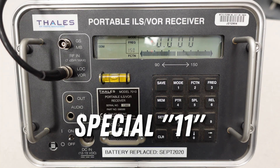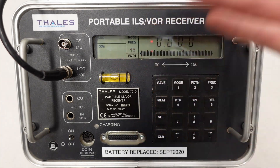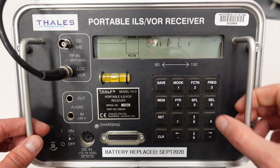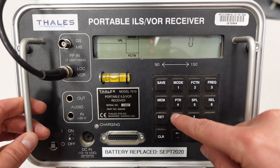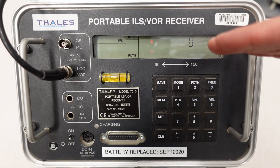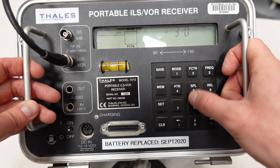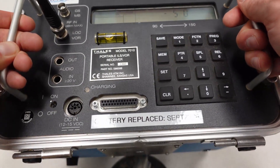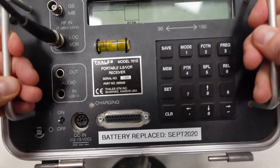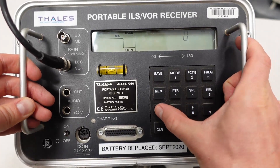The first is special 11 — LCD viewing angle. If you have the PIR positioned high above you or low below you, you can change the viewing angle of the LCD display by hitting special, entering 11, then set. Right now it's set to zero. If I enter a negative value like negative 40 or negative 50, the display disappears from the current viewing angle. Turning it up would make it readable from that point of view. I'll put it back to zero and hit special to exit.